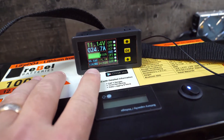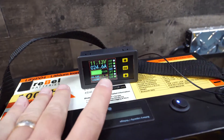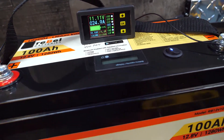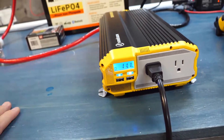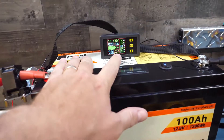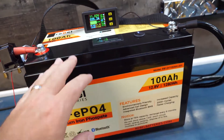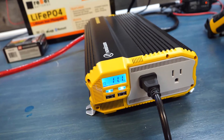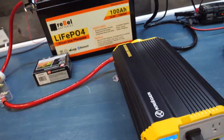We just crossed 1280 watts — 1282 total. We were trying to get to 1280 and we made it. Voltage has been dropping pretty quickly and we're at 11.1 volts. The runtime was almost five hours — four hours and 56 minutes. The battery will go all the way to 10 volts, but this inverter is only going to let us go to 11, so it's getting ready to kick off. You can hear the heater starting to struggle.